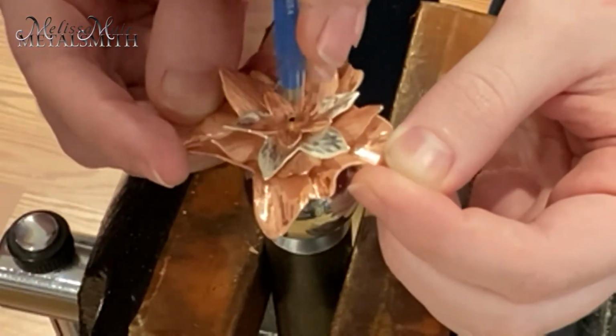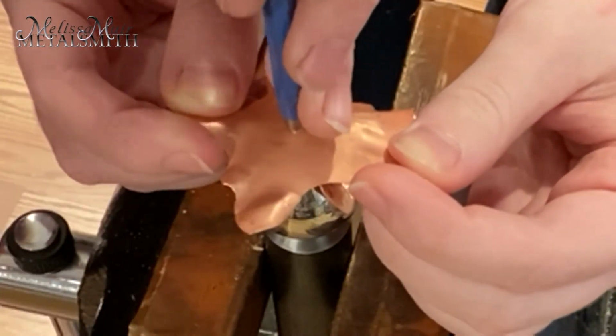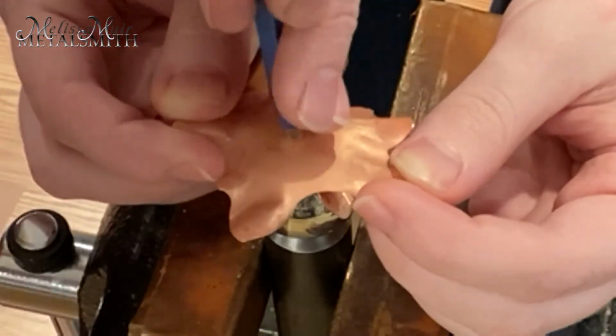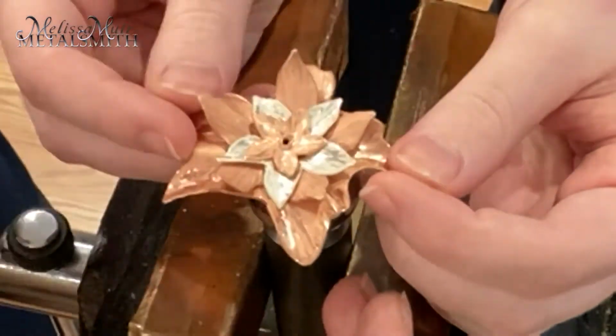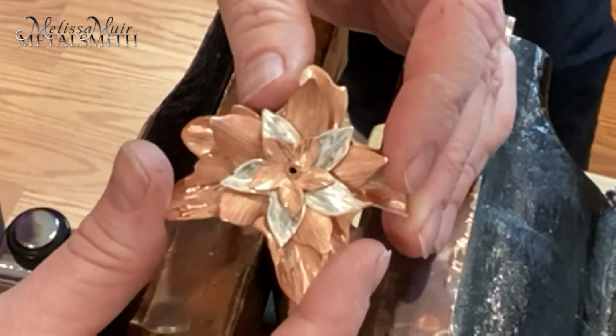To set the tube rivet, I find a second pair of hands is very helpful. Place the rivet onto the ball of a dapping punch. Using the center punch, flare one side of your rivet. Then flip it over and repeat. I continue to flip and flare until the rivet can be finished off with a small hammer. Once completed, apply any desired finish or patina.